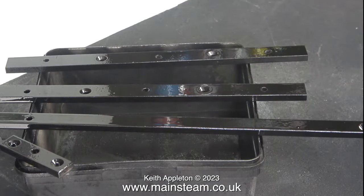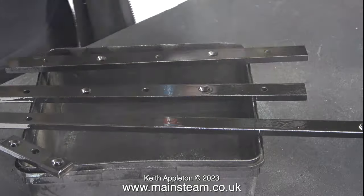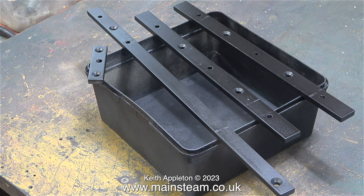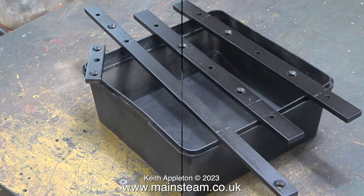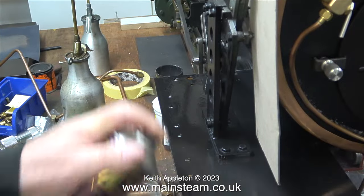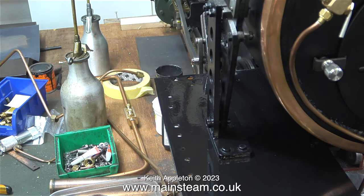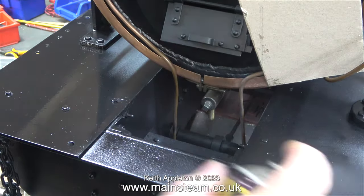In this clip I'm applying the top coat of paint to the cab support rails, and as before I left the paint to dry overnight. Unfortunately this stuff is enamel paint and it's not quite as dry as I would like it to be. This enamel paint is HMG gloss black, and because of the temperature in the outer part of the workshop, it's actually dried a bit dull.